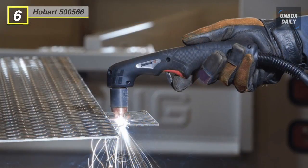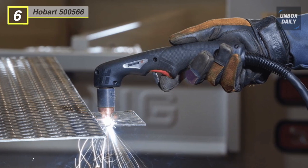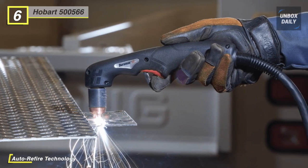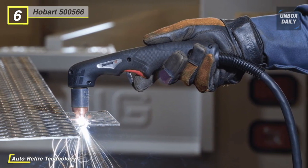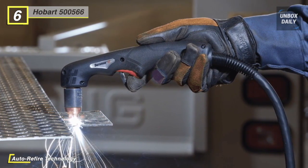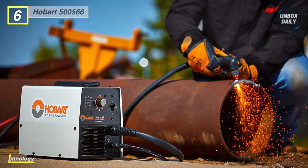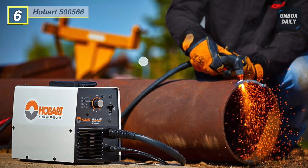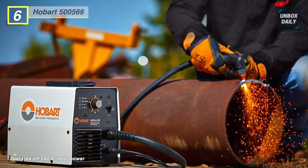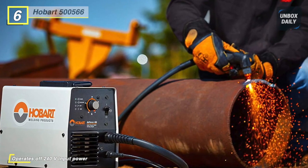The Pilot Arc controller allows you to cut expanded perforated metals and painted or coated surfaces without re-triggering the torch. Its wind tunnel technology prevents abrasive dust and particles from damaging internal components. The fan on-demand cooling system operates only when needed, reducing power consumption and contaminants drawn into the machine. However, its post-flow cooling circuit extends the life of consumables and torch by cooling them with post-flow air after the trigger is released.